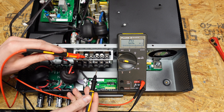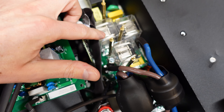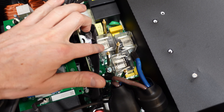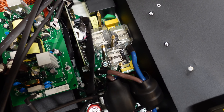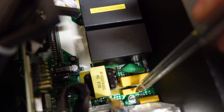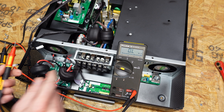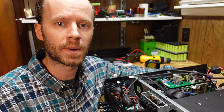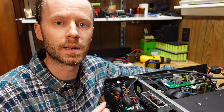While this inverter is off, there is continuity between the neutral and ground on the output side. We have three relays — this top one appears to be for the neutral. It's very difficult to trace the circuit without removing the board. I did see a screw marked with a ground symbol down there, so I removed that screw and the neutral-ground bond is now gone. It does appear you can remove the neutral-ground bond, and there seems to be space intended for removing that screw. However, I am not an electrician nor an engineer, so I would not remove that screw unless the manufacturer specifically tells you it's okay to do so — I'm simply pointing out where the bond appears to be occurring.